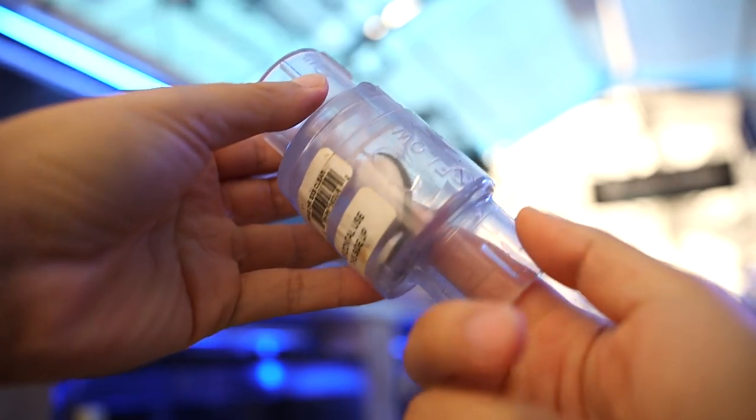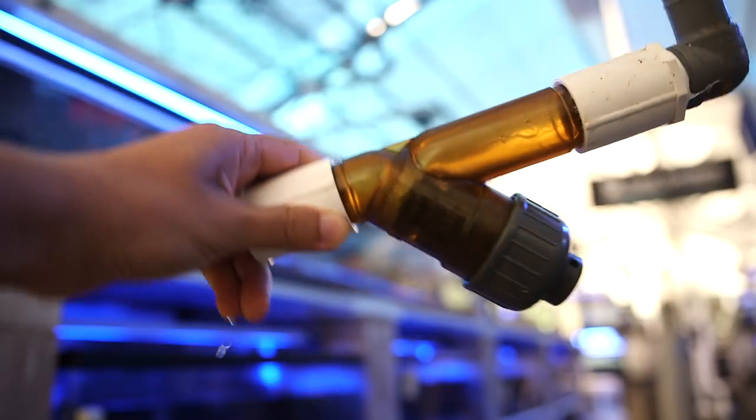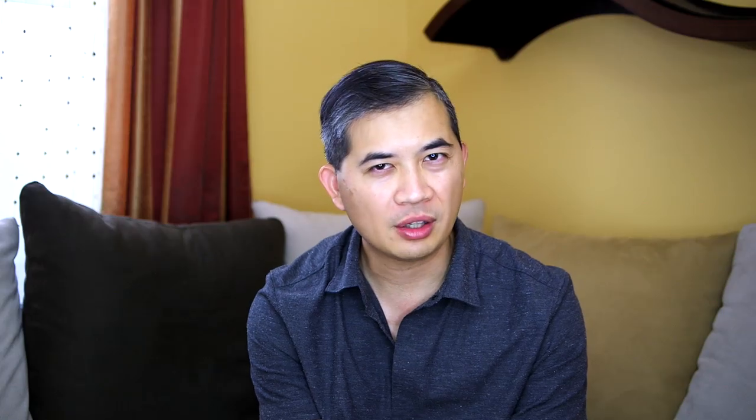Either have some sort of siphon break — sometimes people drill a small hole near the top — or use check valves, like the toilet flapper kind or a Y check valve, which is higher quality and more reliable. But neither of those is really 100% reliable, especially over time as things accumulate and cause them to fail. Those things typically aren't a fail-safe; they just allow a small trickle, basically buying you time. Had you designed your system properly, you wouldn't need that extra time. Make sure that when the power goes out entirely, it doesn't cause a flood and doesn't drain your tanks.